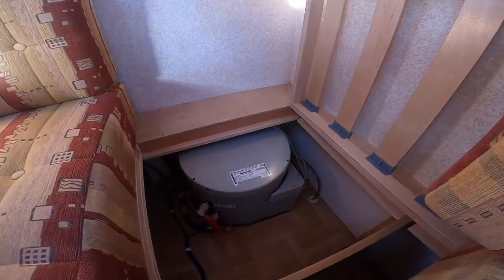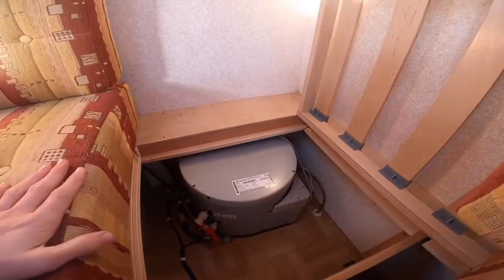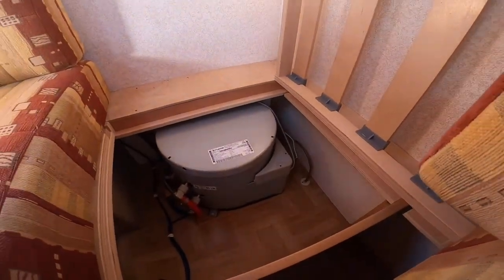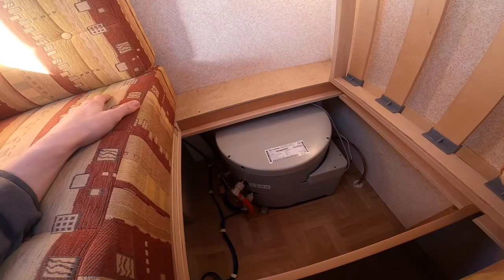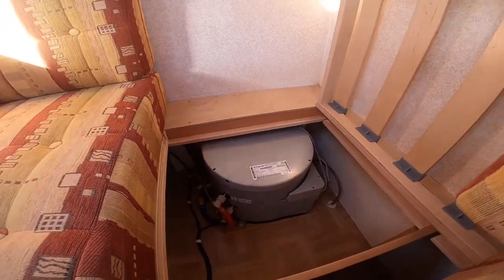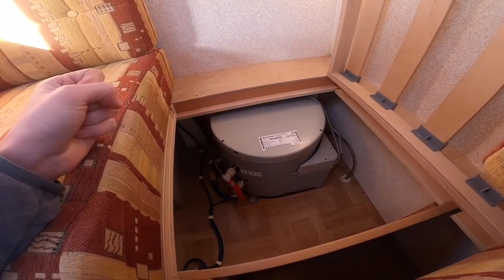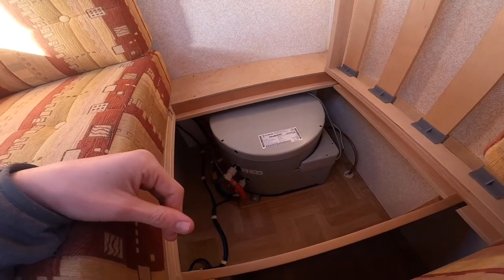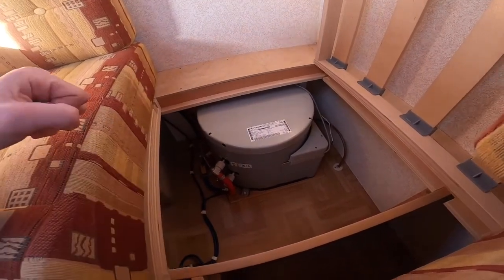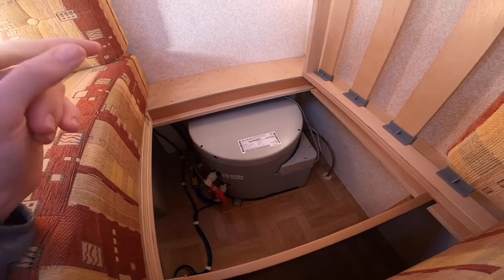To refill, shut all taps within the vehicle, go outside and fill the tank with water, then come in. On your control panel, put the pump to internal. Go to the cold side of the tap first — you'll get automatic cold water pressurised flow. Go to the hot side and it'll cough and splutter, allowing the air that's accumulated in the system out until you get a free flow of water from the hot side. This is when you know your system is primed. Remember to drain the boiler down as one of these is very expensive and isn't covered under any warranty.